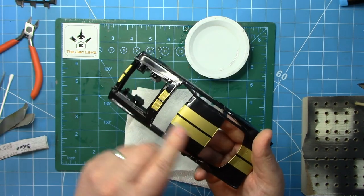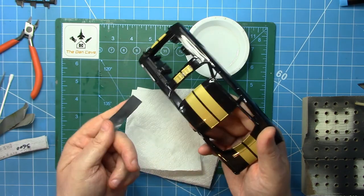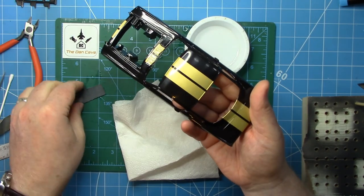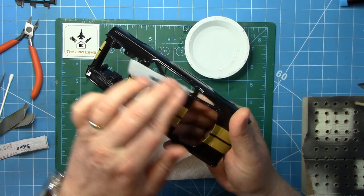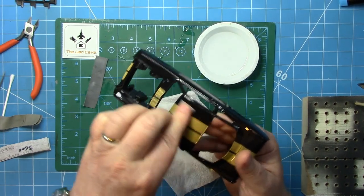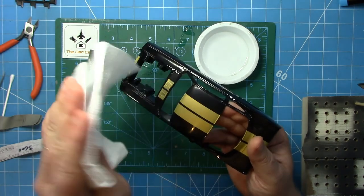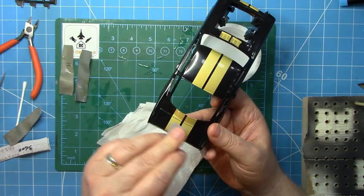Using some water — best to use this stuff wet. That definitely helps stop trapping any particles that are coming up and making scratches worse. As you progress with a wet surface, it's hard to see exactly what's done and what's not, so dry it off every now and again and re-wet the micro mesh as necessary. Using a forward and back motion to keep the abrasions reasonably consistent, then progressing through 6000, 8000, and 12000 grit.